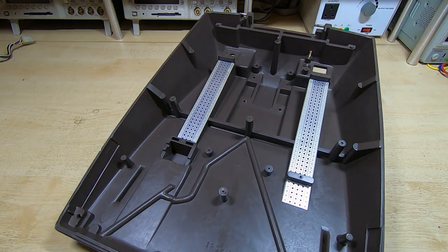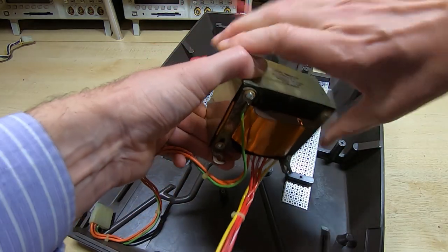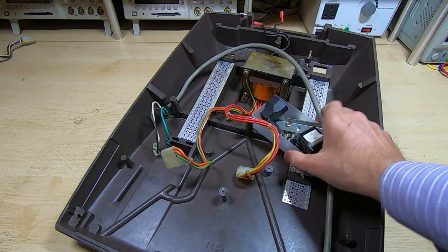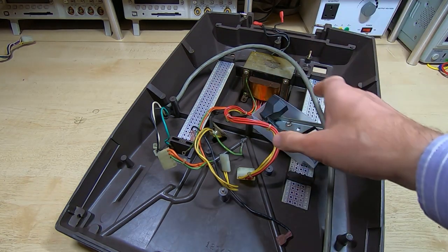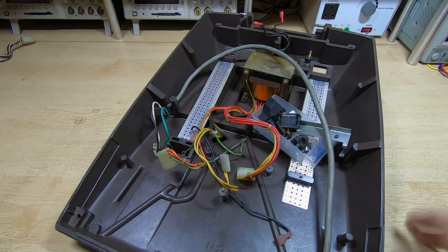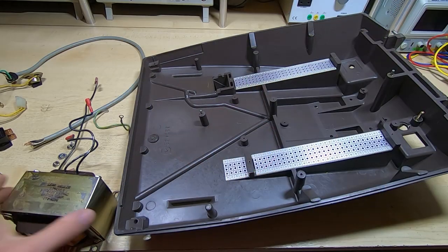I've posted a separate series of videos in which I have rewound the main transformer, and I've now finished reassembling that — I've put the screens on and this is now ready for refitting into the chassis. So what I can do now is reassemble the entire chassis and refit all the parts that I removed. We've got some various bits and pieces, some wiring, earth leads, that sort of thing. Some are a bit grubby so I'll give those a clean as I proceed, and then the next step will be to start to refit the main board and see if we can bring this unit back to life.